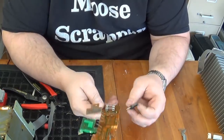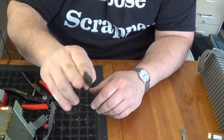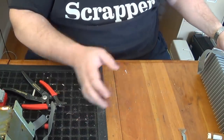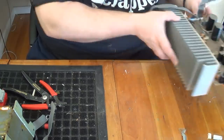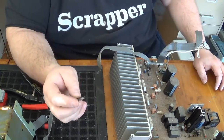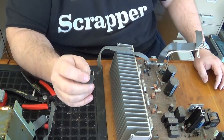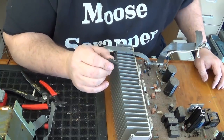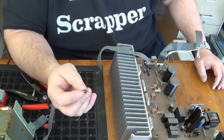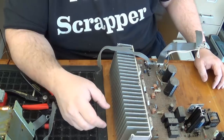So you want to make sure you keep these and put them aside — something I just learned recently is to hold onto these things. You can process them like you do IC chips. You have the added benefit of usually there being another chunk of copper in there. And if you do like I do with my IC chips and put them in old AP to dissolve the legs — if there's silver or any other kind of precious metals coating the legs, you'll be able to capture it that way.